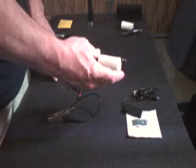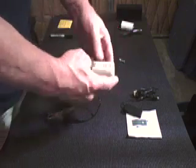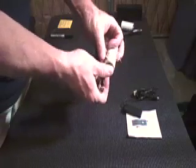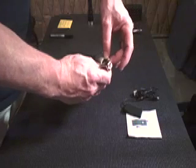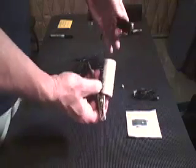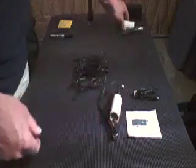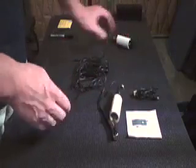I also chose to use PVC piping — this piece is about two and three quarter inches long. I drilled a hole, and there's a little taper that's basically going to go onto the clip like this with a screw. I cut the screw down to three quarter inch; it's a 10-24 with a nylon lock nut. After that's all tightened up and bolted in, and the wires are connected, the transmitter just slides in — it's got a soft rubber coating on the outside so it slides right in, just enough to access the on/off button. It stays in there snug.